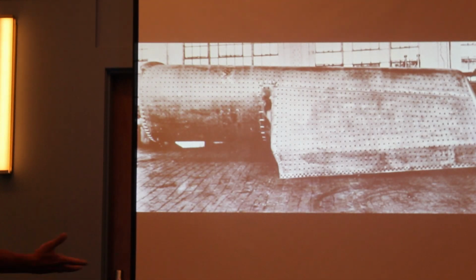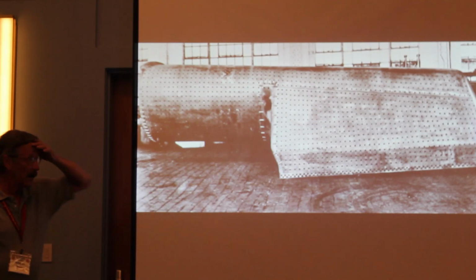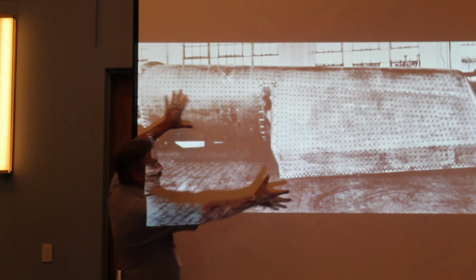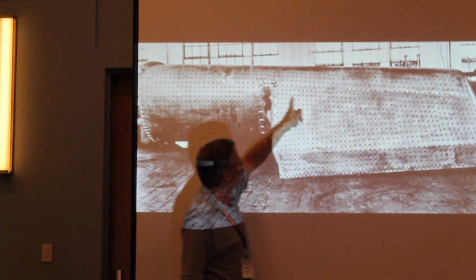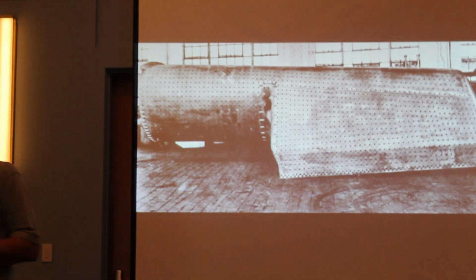All right, maybe you've probably seen this before. This is actually number 1200, the first A. This is the firebox, and this is the combustion chamber, and this whole thing goes inside the shell. As you can see, it's set up for welding. You can see the weld seam here. There are no riveted anything in that firebox.